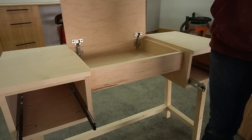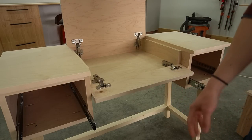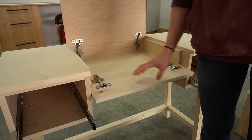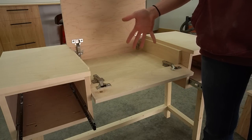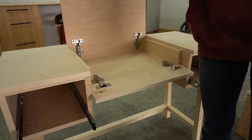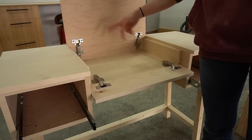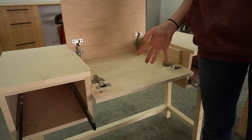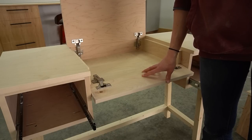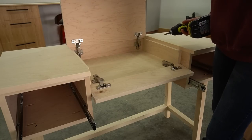To make it easier to stain, I'm going to take the flip pieces back off, but I'll keep the screw holes unchanged so I won't touch the hinge adjustments. When I'm done staining I should be able to just screw them right back on into the same holes and everything should be fine — I can still adjust the hinges a little bit if needed. Honestly, I don't know why I didn't think about that before attaching them; I was just really excited to see what it looked like.